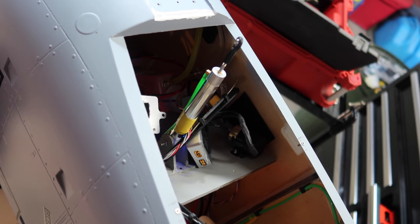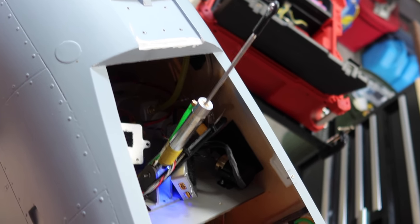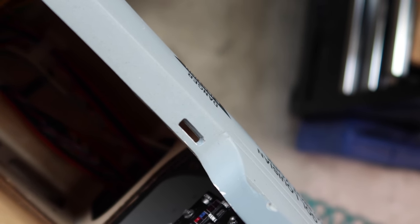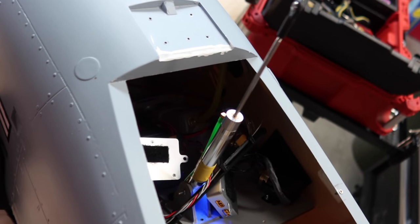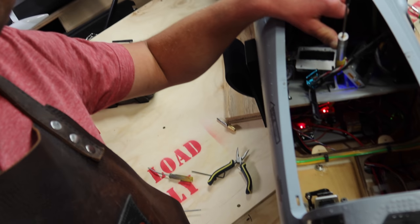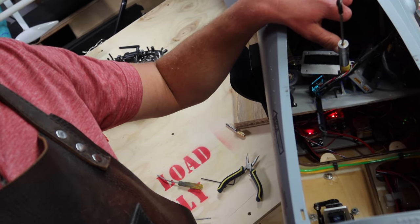The valve has been switched out. The air cylinder works — if you watch the locks: air cylinder closes, locks come on, locks open, air cylinder comes up. Now we can close this back up. Once we get the tray back in place, we're going to take the lines off at the cylinder and put some restrictors in. I'll show those when they're done.